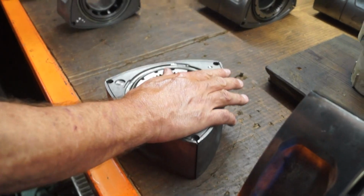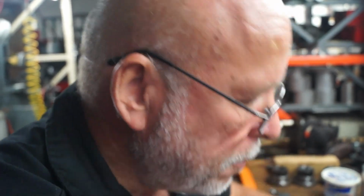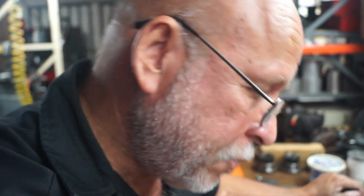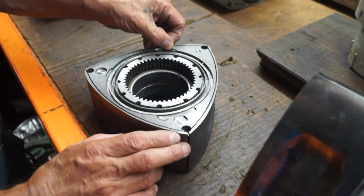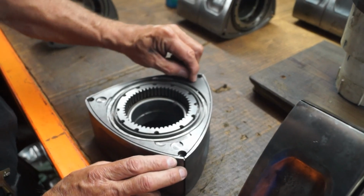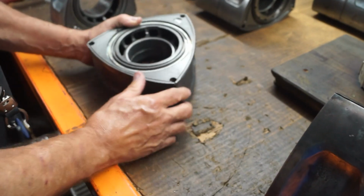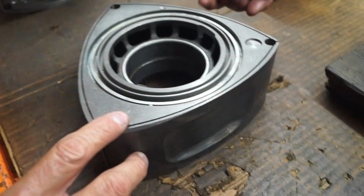Both of these rotors are less than 0.2 grams, something like 0.13, in that range. So I corrected a little bit too much, shifted the weight over, and then took this amount out over here. Finally, my final correction on this side was to kiss it there. On the other side, it required a lot less correction, but again, over here.